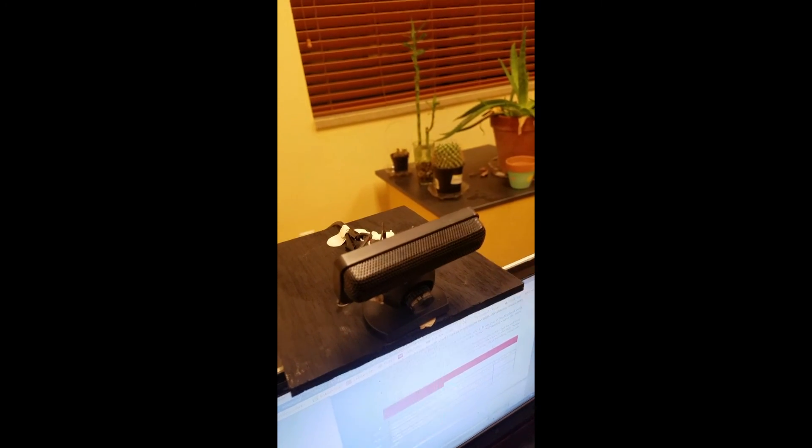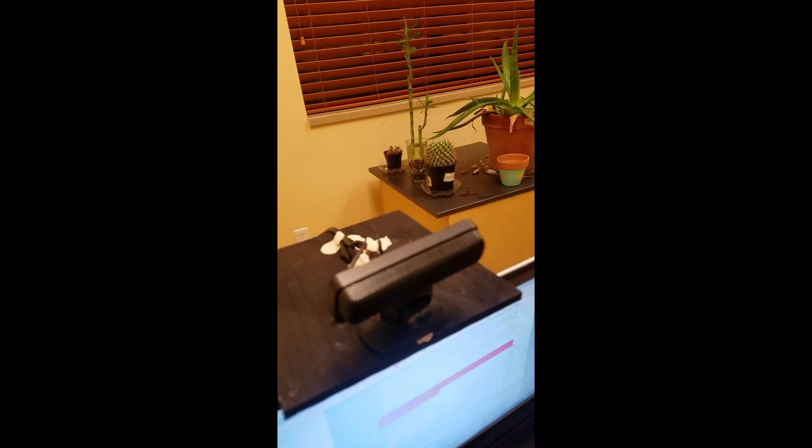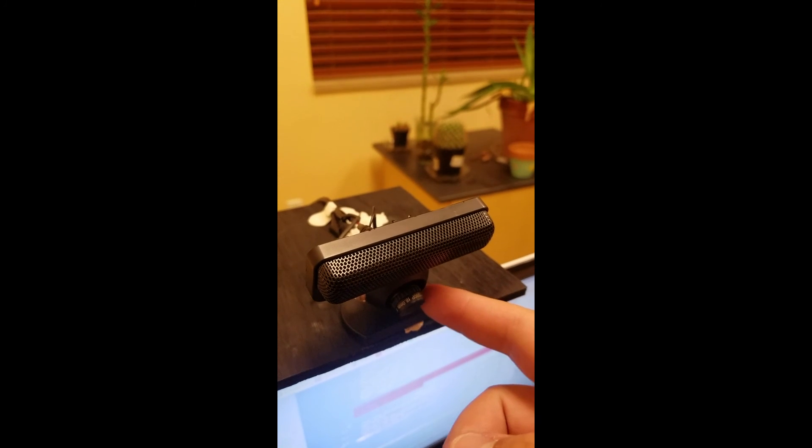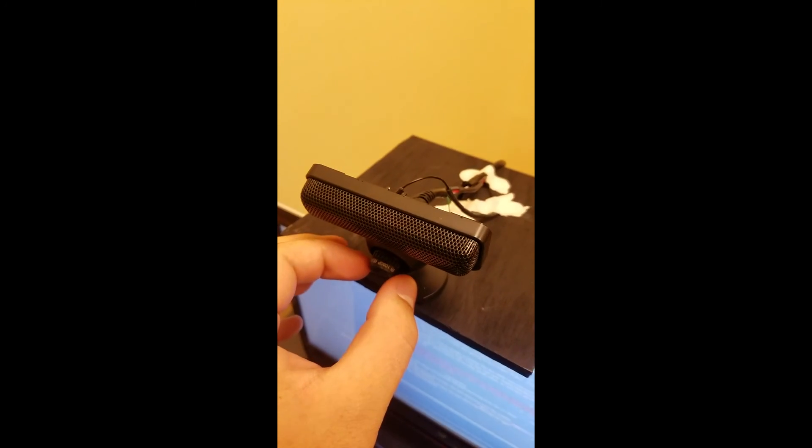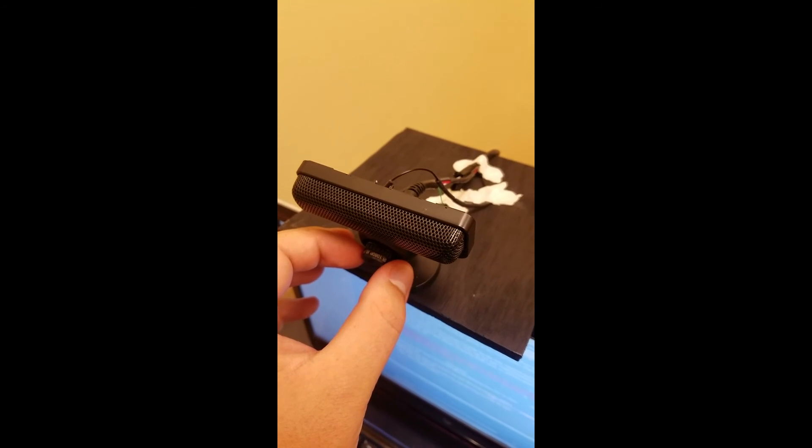For the IR filter, I ended up getting a PS3 camera that could not be modified, so I had to buy another lens and mounts. It's a standard S-mount, except Sony uses a proprietary mount which means it doesn't screw into the circuit board quite right, but it works for this situation. This aftermarket lens I bought is I believe 8 millimeter focal length.